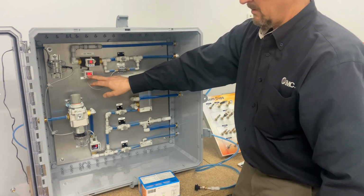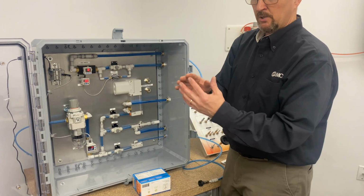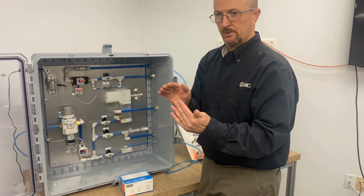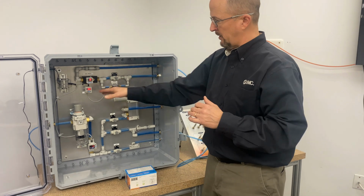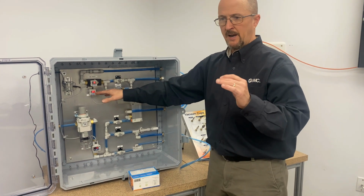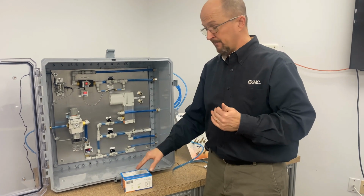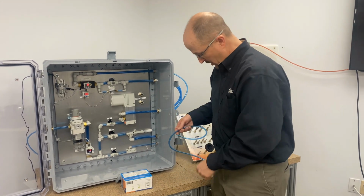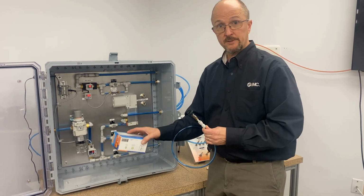So the number, when it went below 3, is actually in the vacuum flow range. Documentation for our units is included with this vacuum test panel, but it basically identified somewhere around 1.3 liters a minute of leakage between your vacuum cup and the cardboard work surface.